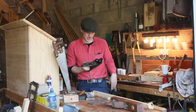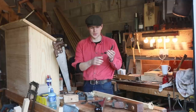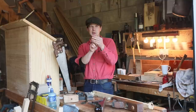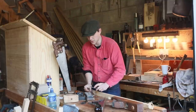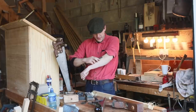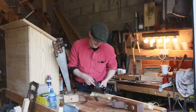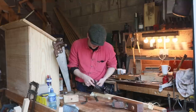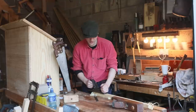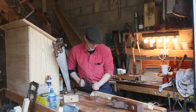The number five is probably already sharp enough but to be fair I'll sharpen both of them. The iron on the Stanley is a lot thinner than the wooden plane's iron — I'd say it's only about one and a half to two millimeters thick. Same story: bring it up to the whetstone and give it a quick sharpen. We test it and the hairs are just flying off. One thing worth noting about wooden planes: you have to be careful when putting the iron in — if the edge touches metal it'll blunt, so just be careful. We lock her into place and that was nearly perfect already.